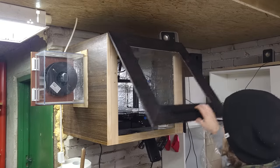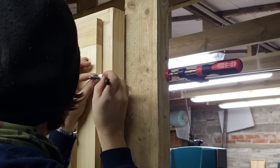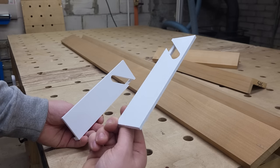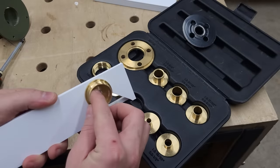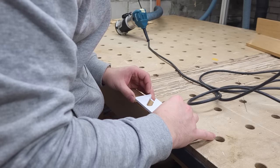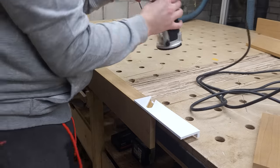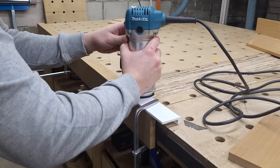I recently got a 3D printer and I've been printing little things throughout this build, like a small spacer I used to set the right distance when marking the door hinges. But what really sealed its usefulness as a tool for me was this template I designed from scratch — I designed it in software and had a real-world product I could hold in my hands. This will help me get perfectly spaced 40-degree dado cuts, and since it needs to be mirrored there's a left and a right side template. I'll upload the files in the description for anyone that wants to print their own, along with the specs of the bushings and the bit I used.